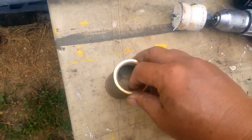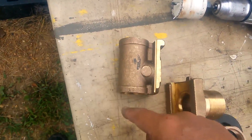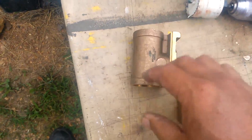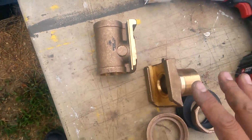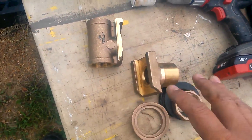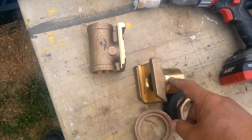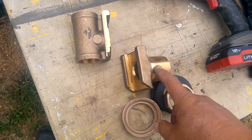This is a deadhead here — it doesn't do anything except guide your pull pipe. This, of course, is all of your pipe going down to your pump, and that's going to pull the load up above the casing until you can get it clamped and start pulling it section at a time. So that's basically the function of the pitless adapter: to provide freeze protection with an outlet below your freeze line, wherever that may be, depending upon where you are geographically.